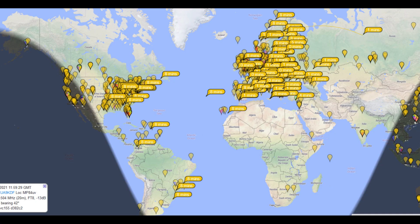That was really impressive. Just before I packed in, I actually tried to call CQ on SSB for a little while, running full legal limit, and not one person came back to me. The SSB spectrum was flat — only three stations, and they were all calling in what I think was the Portugal Day Contest. So I went and had a look at FT8, and honestly on my first CQ I was spotted in North America and South America, but the signals just weren't strong enough — they were like minus 20, minus 23. It's just telling me band conditions weren't there. If you don't have the band conditions, it doesn't matter what antenna you have.